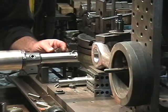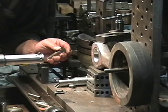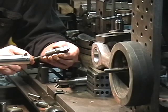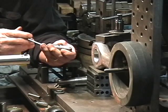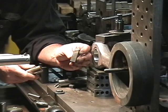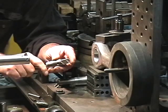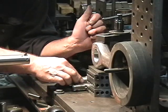In addition to the TR, TSAs and TSCs, they used to have a TSC 30 degrees — they're getting harder to find. Companies like Scully Jones will sell you something like this fella. This is used more on portable boring bars or on large boring tools. It goes into a hole through the center of a bar, and then you adjust with that screw. You use sharpening blocks to sharpen that fella.